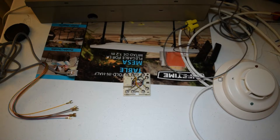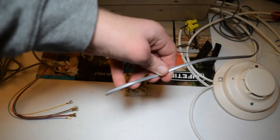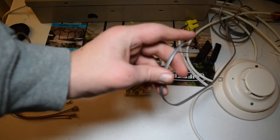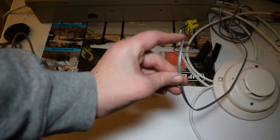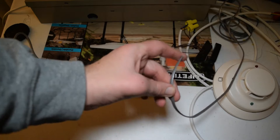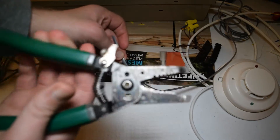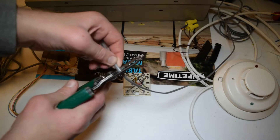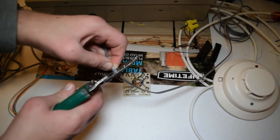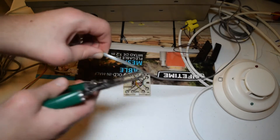First, we're going to start by wiring in the incoming telephone line onto the RJ-31X biscuit. We're going to need a telephone wire without a connector on the end of it. Then we need to cut the shielding back to expose all the individual wires inside. I'm going to use the cutter part of the strippers and do very gentle squeezes — similar to when we were doing the security wire — going around in a full circle. Gentle squeezes to not cut the wires that are inside.